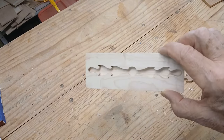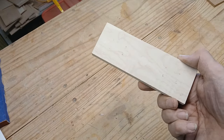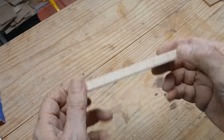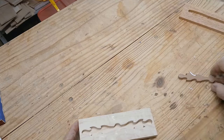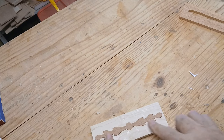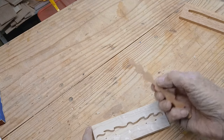That's working well so far. I put that piece of maple back in there — it stuck out, so I used a spokeshave, cut it down, and sanded it. Now I'm going to glue this piece in. It's going to stand proud a little bit, which is fine — I need to sand this anyway. I'll sand that down and get a finish on it. So that's my next step — I'm going to glue that in.